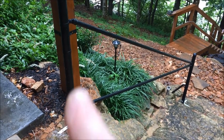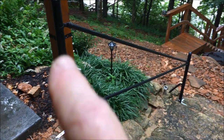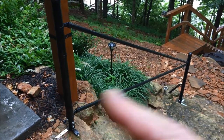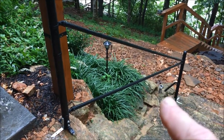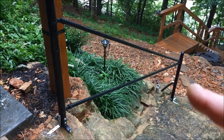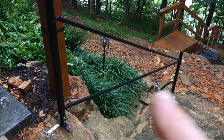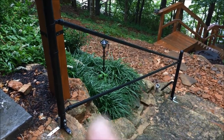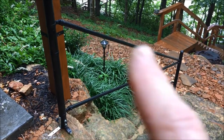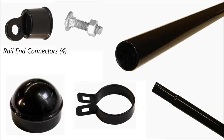The next problem was side-to-side movement. I did a strap, which I'll show you later, to hold movement in one direction. Then I had a little extra piece of fence tubing that I turned into a 45-degree brace and expansion-anchored it into the stone. This thing does not move — it is very sturdy. Now I'll get into the details of how I put this in.